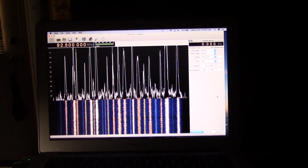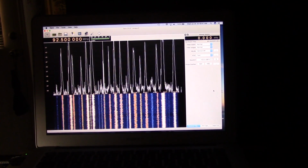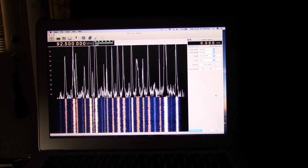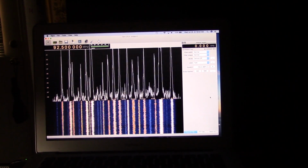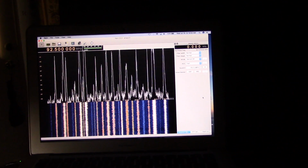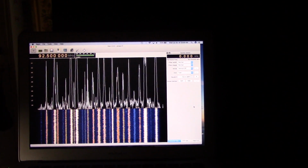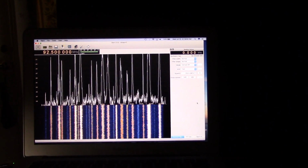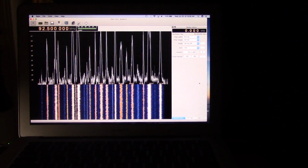a typical direction. Keep in mind that since I'm in Arizona, the skip distances for FM are generally about 500 miles or more. Basically, I'm working from southeast around through east, northeast, north, and northwest. And so with this antenna being on the northeast side of the house, there's just either the ceiling or the walls, but not multiple walls coming through, so I still get a pretty good signal. And so this is pretty typical conditions.